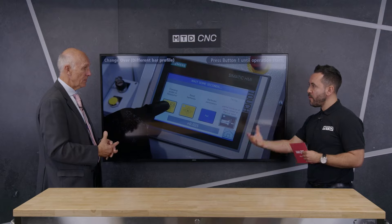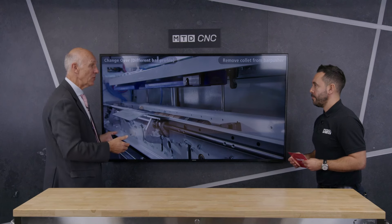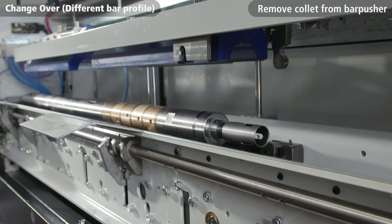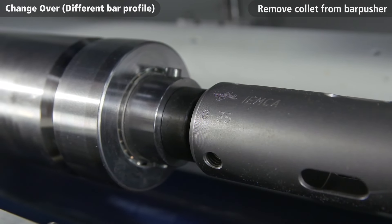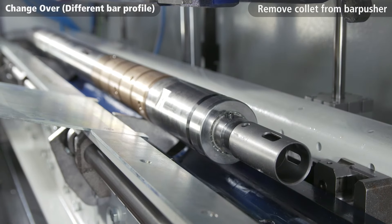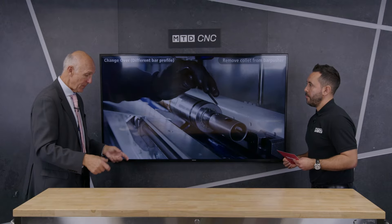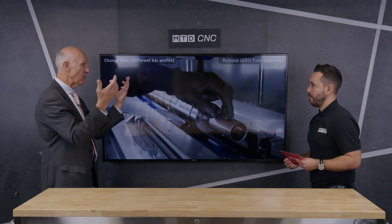How do you load the bars into the machine given how heavy they are? Health and safety and ergonomics are a priority in every factory. IEMCA give you two options: one is a rack system, which you can load with a trolley or a forklift; the other is a bundle system that can hold two and a half tons, loaded via overhead crane or forklift. There's also an open-access bundle option where you lay the belts down, push your trolley in, and put the belts back to finish.